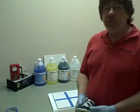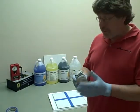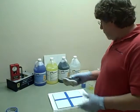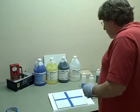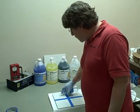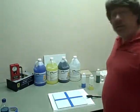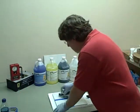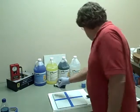It's been about three minutes since I put the product down. So I'm going to take a little baby shoe that I use to test for friction. I'm going to test the four areas and see what kind of results I'm getting. In order to have a baseline to compare against, I'm going to put a little fresh water on the untreated tile. That gives me an idea of how slick the tile is when it's untreated — and I can tell you that it's extremely slick. I wouldn't want to walk on this tile.